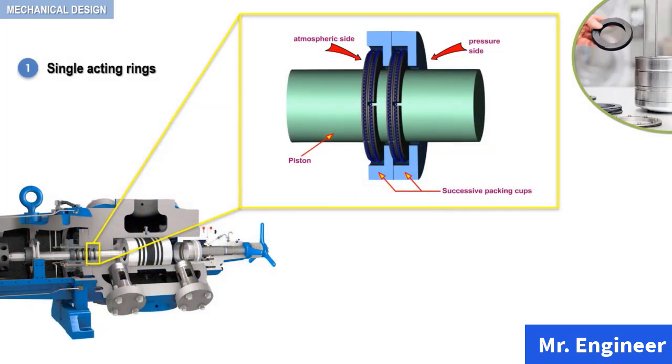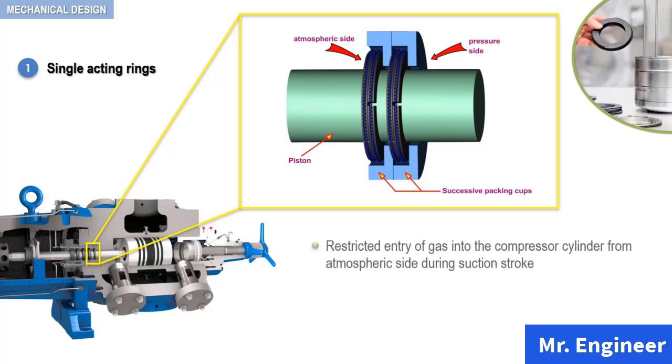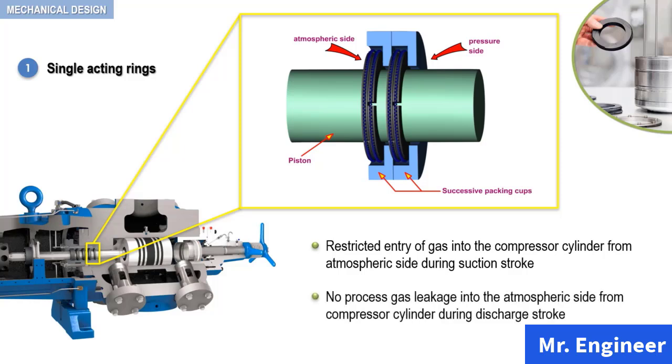So, to sum up, and as explained, the single-acting packing ring assembly facilitates restricted entry of gas into the compressor cylinder from atmospheric side during the suction stroke, and no gas leakage into the atmospheric side from the compressor cylinder during the discharge stroke. In the next video, we will shift our attention to the second type of packing rings, that is, double-acting rings.